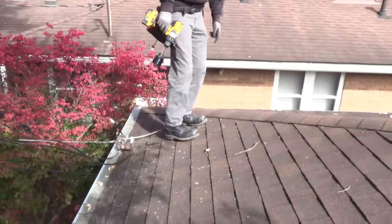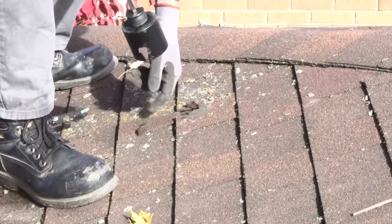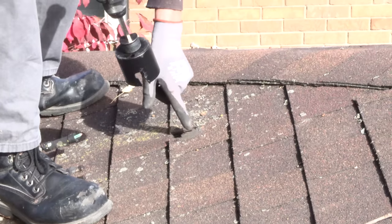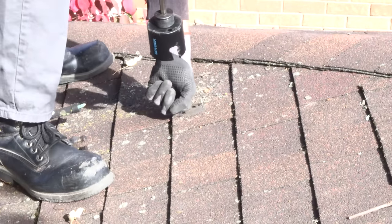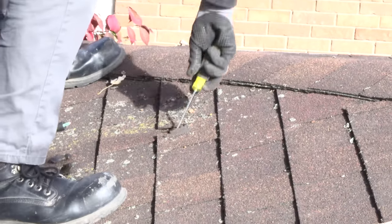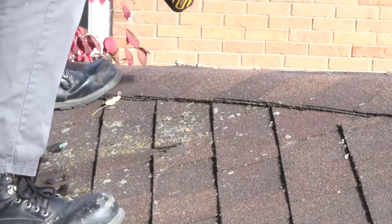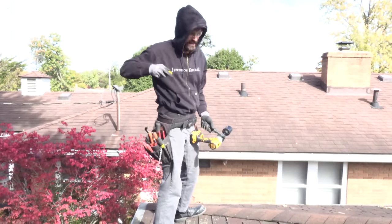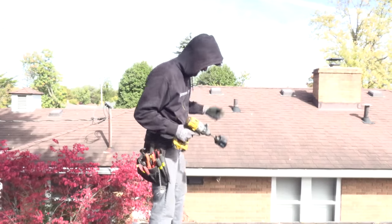See how much movement there is in the roof? There's been water infiltration — the old mast connection was all there was for a long time, it wasn't tight, all dry-rotted. We're going to use a roof boot; the old penetration was a code violation. I can actually pull the roof decking apart with my fingers. Thankfully there's a rafter right there for support. I can stick a screwdriver about two millimeters into the rafter, but it's not as bad as when you find a fully rotted framing member you can push your finger right through.